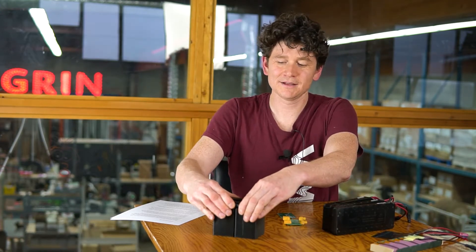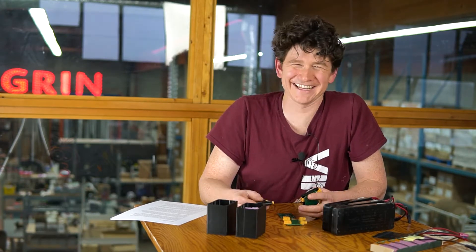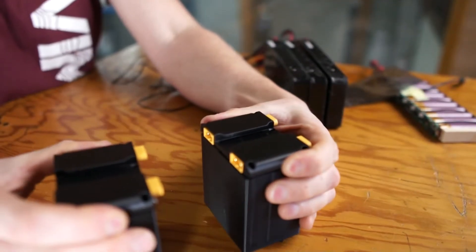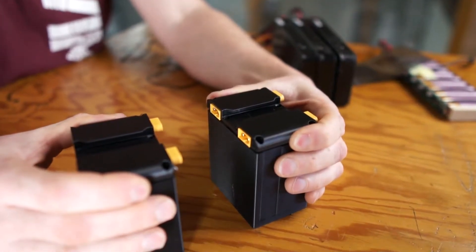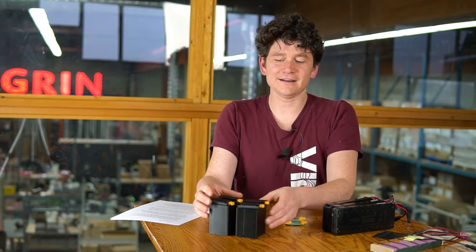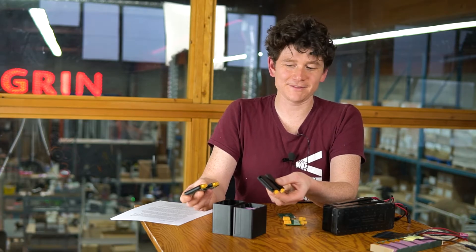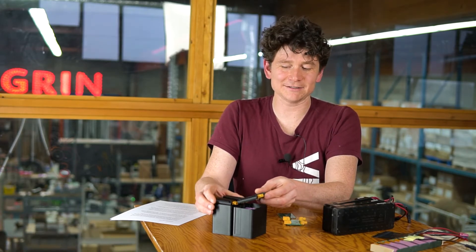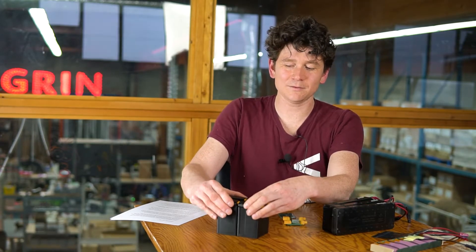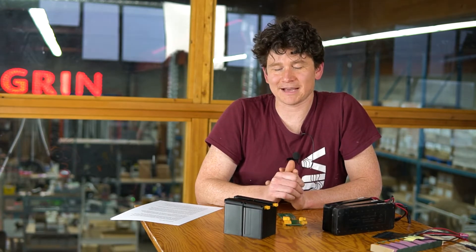We're calling this our LIGO 10X. It takes a lot of lessons learned from the original LIGO and solves them. The first and most obvious difference is a different form factor — rather than being a long slender battery, the pack is more compact in a 3-4-3 cell arrangement. This updated form factor lets us connectorize the batteries with mating plugs, which is the most significant improvement for the end user, because it means there's no longer a dangling mess of wires. The batteries simply stack one behind each other, building up an ever larger battery depending on the pack size you need.